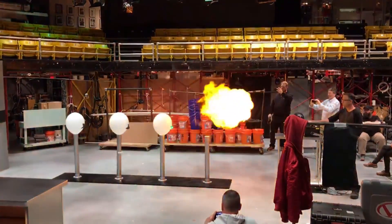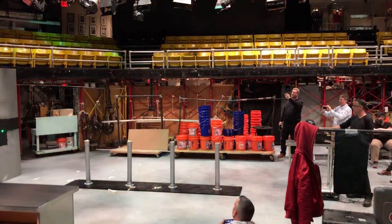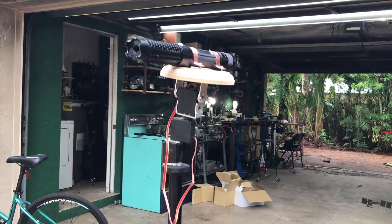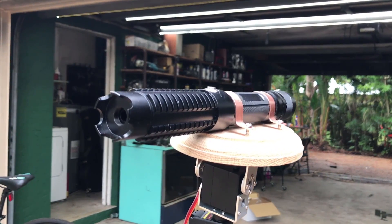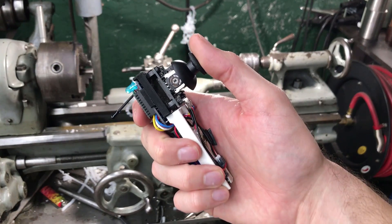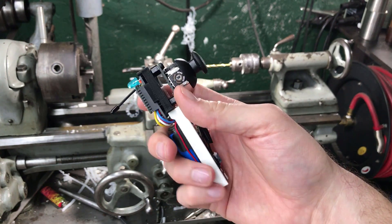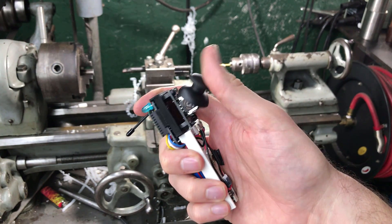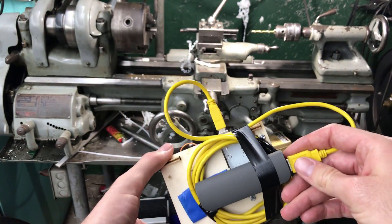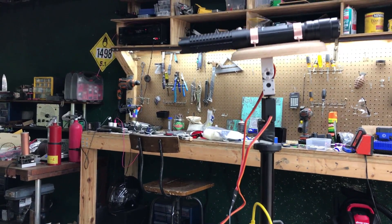For this collab with Kevin, I decided to build on what I learned doing exploding hydrogen balloons on The Tonight Show. I took my 3-watt blue laser and made it into a remote control turret. To get pan and tilt capability I mounted it on a pair of high-strength servos. To control it I designed this remote control — it runs off a rechargeable battery and sends joystick position information through an XBee radio. To control the servos I threw together an Arduino receiver that runs on a battery pack, receives the signal through its own XBee radio, interprets those signals, and tells the laser where to point.